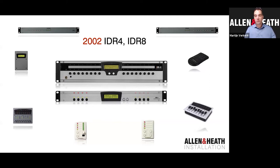So you could use the CAT cabling, which at that time was a standard, but not highly available in buildings. So you wouldn't worry about putting that PLANet cable into your computer. If you used the Ethernet port of your computer, again, at those days, very rare, you would blow out your Ethernet port because there was no PoE standard at that time. So our PLANet power was a lot of power for them.